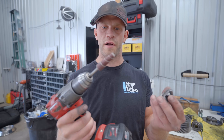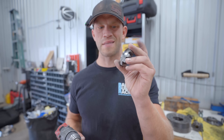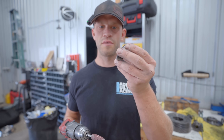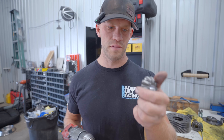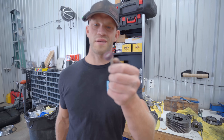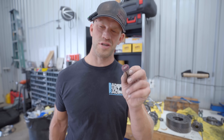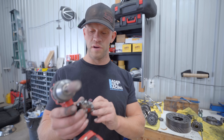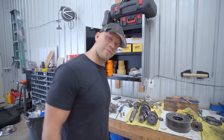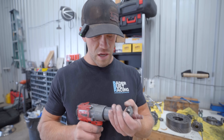I'm taking off all the metal that transferred from the pins onto these gears. There's quite a bit, so it's going to take a while. Then I hit it with a Scotch-Brite wheel to polish it out and get any high spots off from the sandpaper. At the end of the day it should spin nice and smooth and free, like it should from the factory.